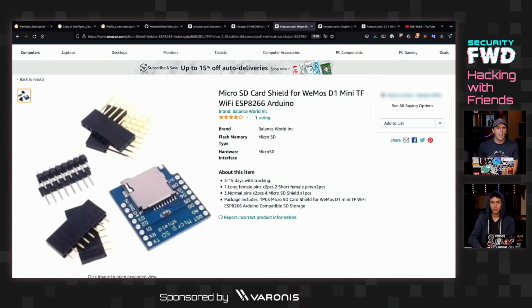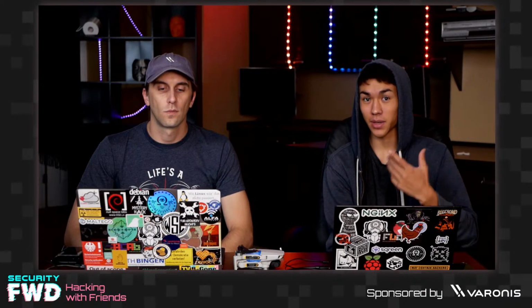If you use the Raspberry Pi, you're probably familiar with these because it's a really popular way of taking a base board like this D1 Mini and then through just dropping something on top of it and soldering it in place, having the ability to add sensors or other different peripherals in a really accessible and predictable way. Now, we basically took advantage of having multiple hats left over and just soldering them together to create a signals intelligence platform. And what we're really doing is Wardriving. So Alex, do you want to explain what Wardriving is? Yeah, so Wardriving is basically a process where you conflate both Wi-Fi scanning and GPS mapping.